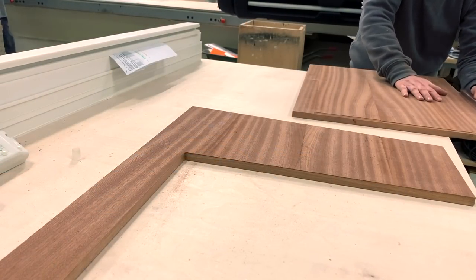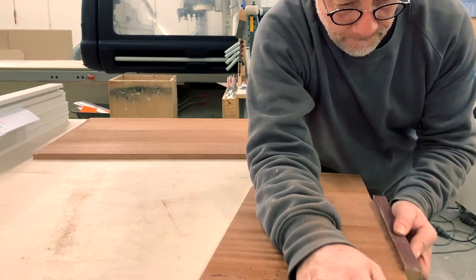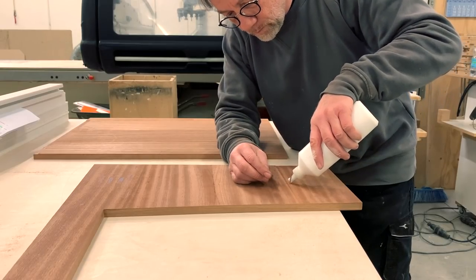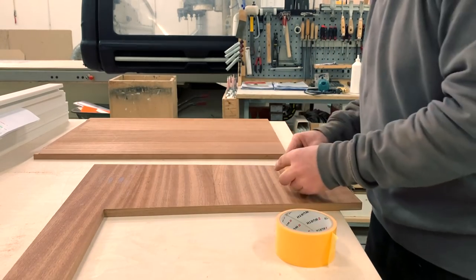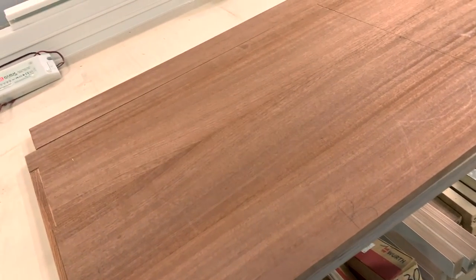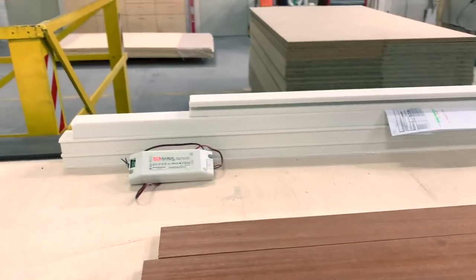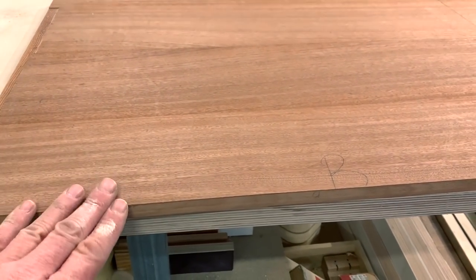You can see the good grain. Now I need to sand the borders of all these pieces. Taking out the tape, I ruined a little of the mahogany sheet, so I need to re-glue this small piece with glue, tape, and clamps. This is my raw chart table - I need to fix some things around here and cut the excess, but this will be my new one. You can see the mahogany veneering and the end grain of the mahogany - it's better than the original.